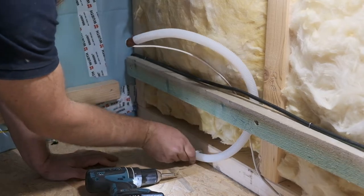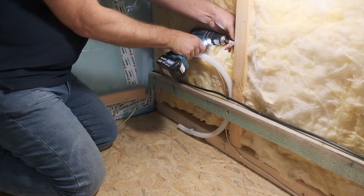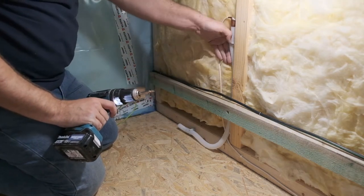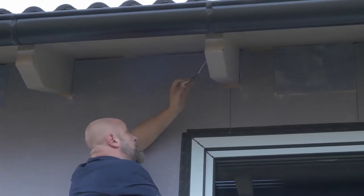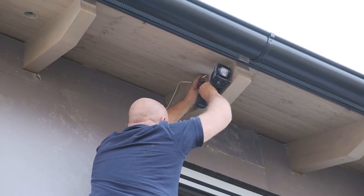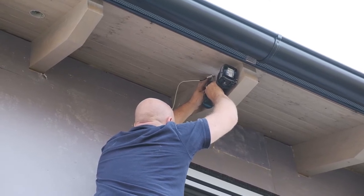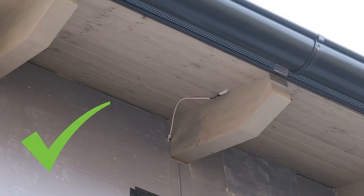The HT sensor is also used as an exterior sensor, and it measures the parameters that affect the house during the year. The sensor installed outdoor must be protected against rain and direct sunlight. That is why it's ideal to install it at the northern side or under a roof overhang. The sensor can be freely accessible and visible, or it can be installed behind the underside and hidden behind ventilation grating. Or it can be installed in a wall in, for example, an electric box covered with grating.